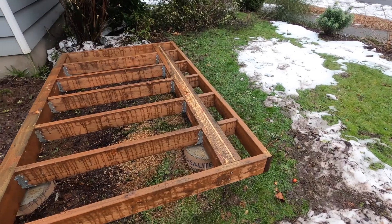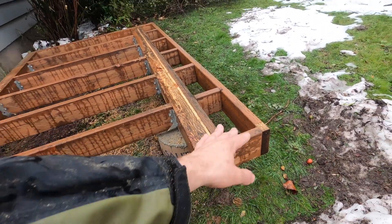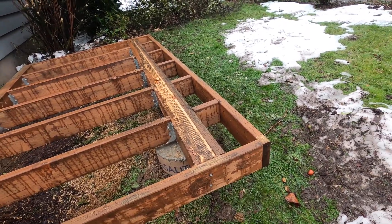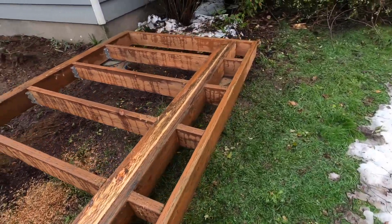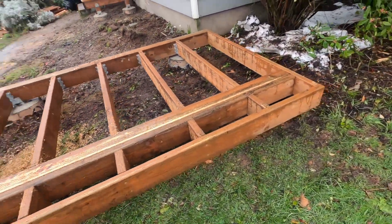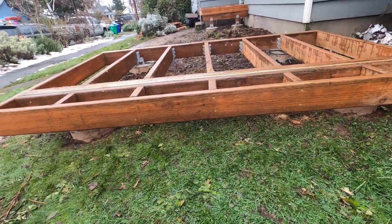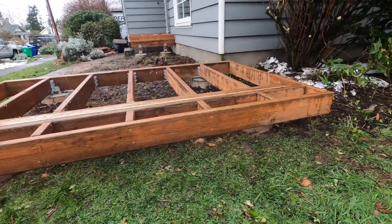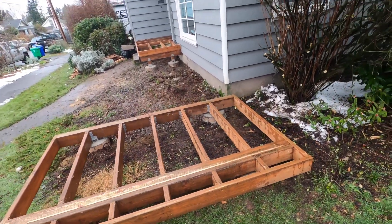Another abnormal thing I did was stop this beam inside of the end of my platform. I stopped it at 4, and this ends up being 5 feet. It's quite a bit of extra work because I didn't want the footings to be revealed from the street side — I want this side to look good. So there's a lot of extra work, time, and a little bit of extra material to get that, but that's the type of thing I try to think about every time I'm building.